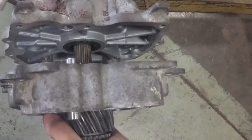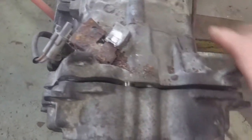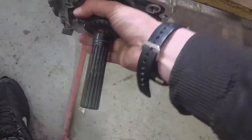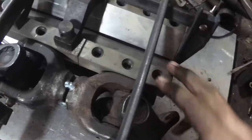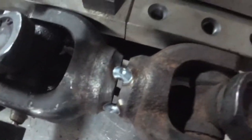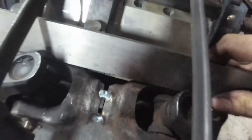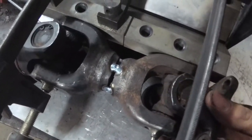Here we go. Alright, this is my setup — I got two V-blocks clamped together. I have the straight edge to make them even, and both the yokes clamped to the V-blocks. I got three tacks on it right now. I've been putting the straight edge in across those faces and shining a light there — they're close enough. This whole thing's about close enough; little vibrations shouldn't kill us. So I'll get a fourth tack on there, double check it, and fully weld it.